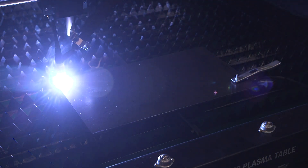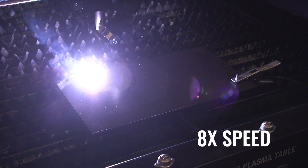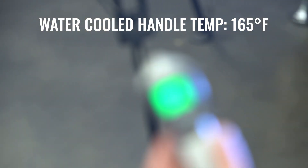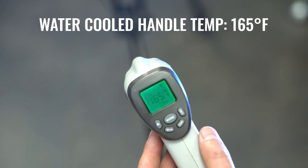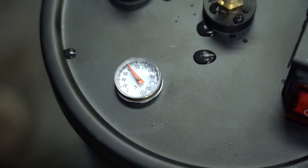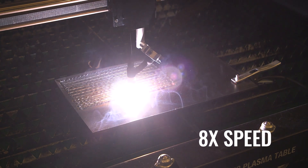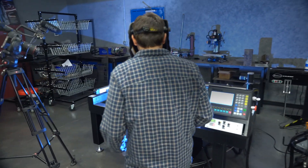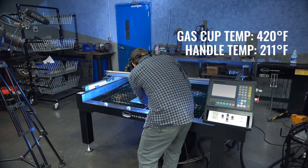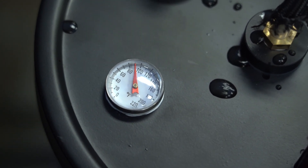We're running the same amperage here — 224 amps. That's how consistent this machine is. We're at 165 degrees at the handle. We're over five minutes in and our water temp has only gone up about 10 degrees. This is at 220 amps, maxed out on the TIG 200 AC-DC. At 10 minutes in: 420 at the cup, 211 — that's a heck of a lot better than what we saw with the air-cooled torch, and it's definitely dissipating the heat nicely.